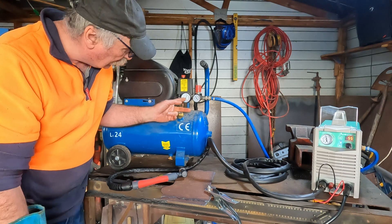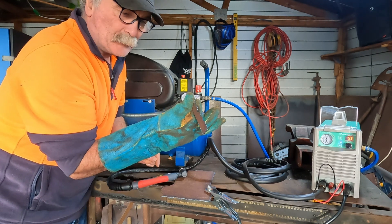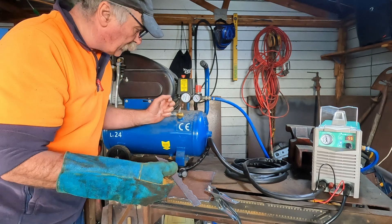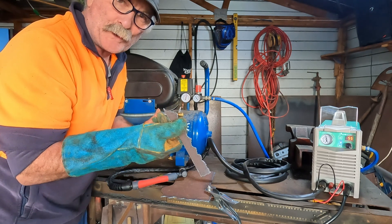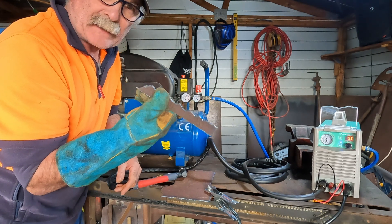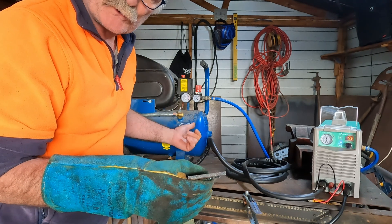So there you go guys — see that it restarted again. We're running back up to 100 PSI, but we did manage to cut through this. It just depends what you want it for. If you want to cut big huge sheets of metal, this is going to be no good. But if you want to just cut off bolts, rusty bolts and stuff like that, or you're working on your car cutting out panels with quite short runs — it worked, didn't it? Let's see how thick we can actually cut. Right here guys, we've got 5mm now. So this little compressor will probably struggle at 5mm, but we'll give it a crack and see what happens.